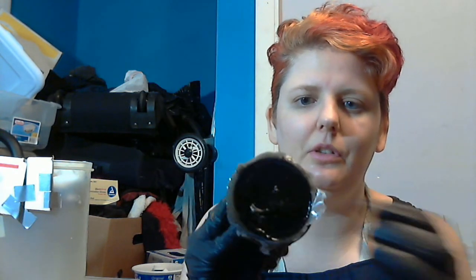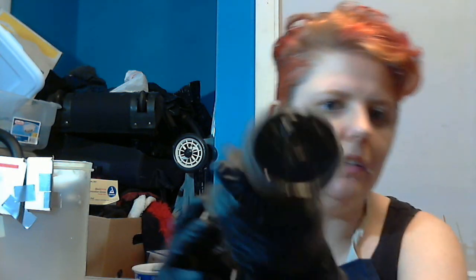And there is the bronze Lady Vinsmith — you can see there's not a whole lot of flashing, except for the bottom where we have the overrun. That's really easy — I'll just take a box cutter and trim it off. When I go to finish this it'll get cleaned up even better with sandpaper and everything. The bottom got kind of wrinkly. I'm not entirely sure why — I think it has to do with the temperature in the room. Since I had the window open it was a little colder in here than usual, because it's beginning of May in Maine and it's only about 45 degrees outside right now at about midnight.